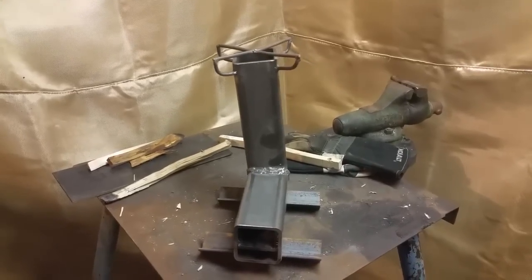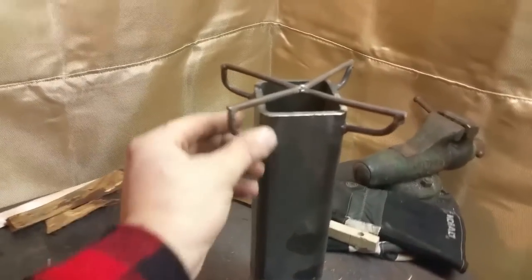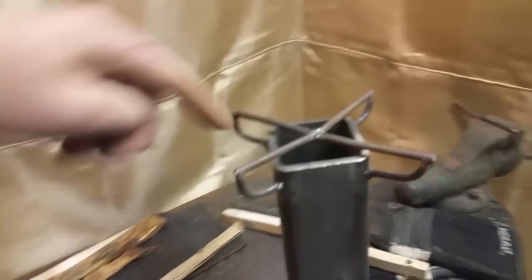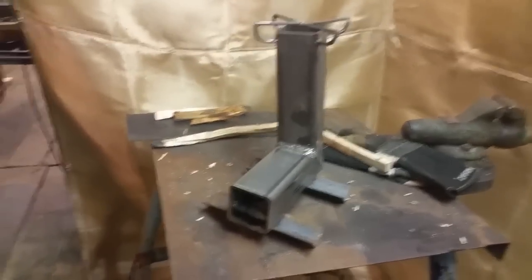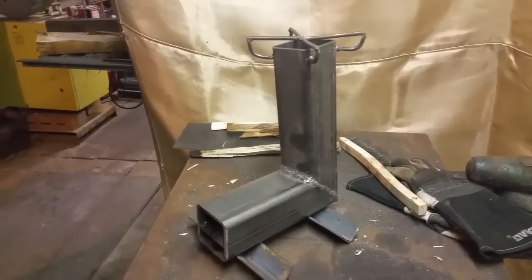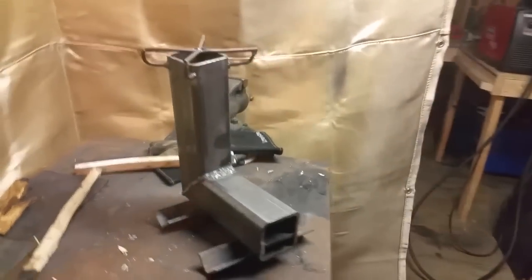A couple of afterthoughts after the initial burn on the first version of the rocket stove: I came out with a small pot of water to boil and the burner stands were too far apart. So we decided to weld on some small pieces to make an X shape — now we can fit any size burner there and still fit starter fuel down there no problem. The unit burns really well. It's not a long-term sustained burn stove by any means, but it'd be cool to keep it at the off-grid cabin as another way to boil water or light a quick fire.